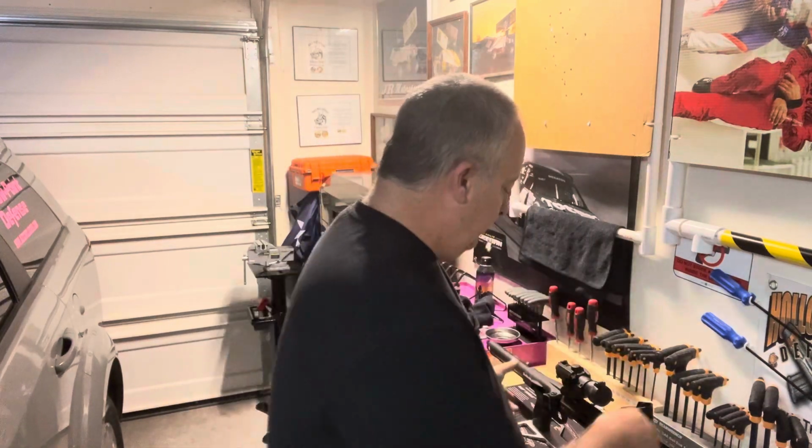This thing right here is pretty much aluminum. So if you are taking these handles in and out, be careful. Don't over tighten them. It is aluminum, and if you try to tighten it up like it was steel, obviously you're going to strip it out. And then there goes another $50 piece you're going to have to go buy. But so far, I did like it. So let me go to the gun itself.